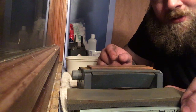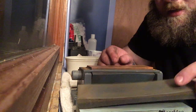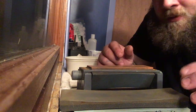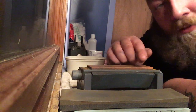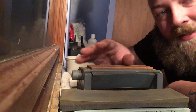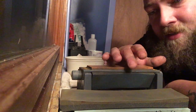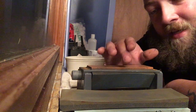We're also going to be using this — it's the first stone I ever got. This is a Smith's double-sided stone. The coarser side is, I believe, 100 grit, and then it's either 220 or 240 on the top. I'm really just going to need the 220 side. The 100 grit I only use if I'm doing edge reprofiling for higher-end steels like ZDP or S110, or if there's a serious chip or roll. But this 220 does a great amount of work — I probably use it three or four times for every one time I use the coarser side.